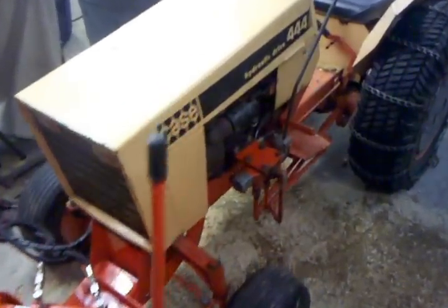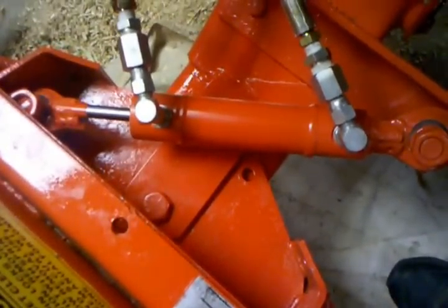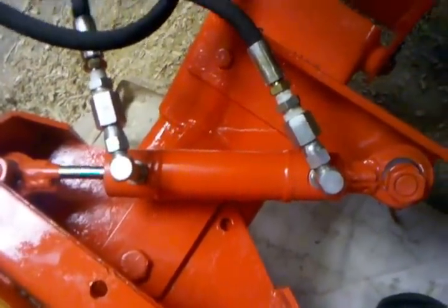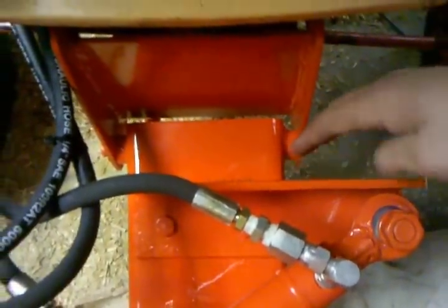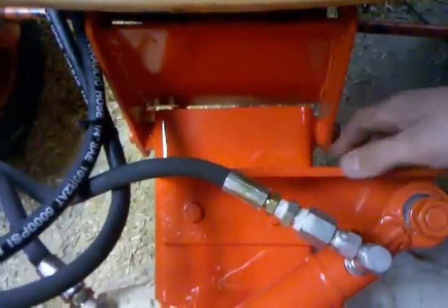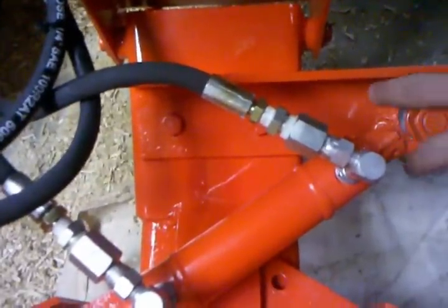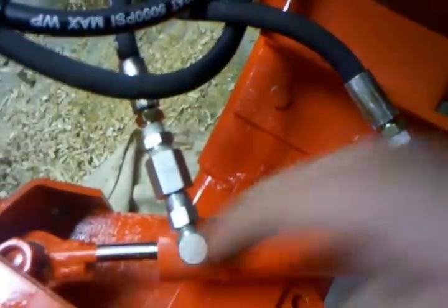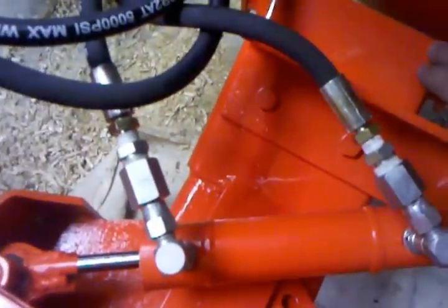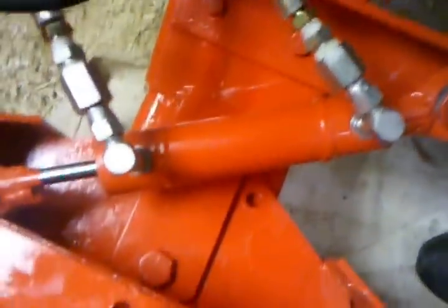Basically, I've got a cylinder right up front with about a six-inch throw on it. Here you can see my mounting plate — I used a piece of angle iron. There's good enough space here so when the plow is all the way up, it won't touch and bend anything. It also keeps the cylinder far enough out so that you've got a good anchor point and don't have to anchor from up inside.